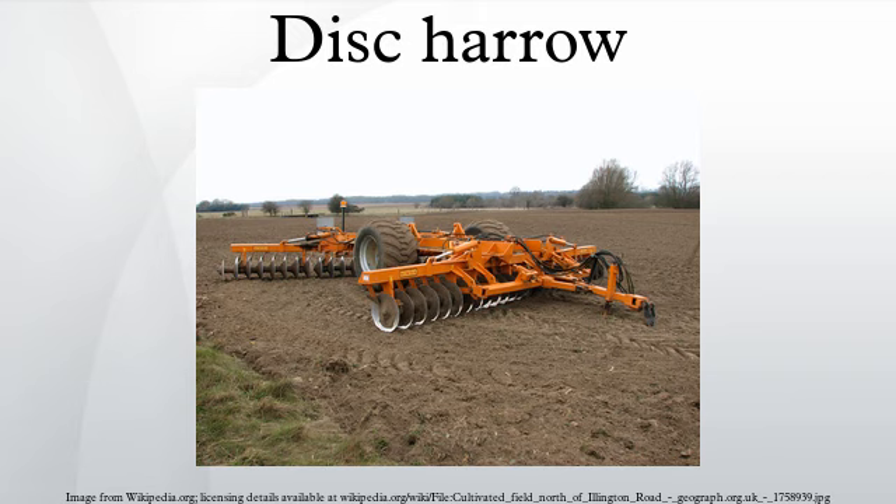Prior to a planting operation, a secondary disc harrow with narrow disc spacing of 8, 9, and even 10 inches, with disc sizes ranging from 20, 22, 24, to 26 inches can be used. Other similar secondary tillage tine implements or rotary harrows are also widely used. When choosing secondary tillage equipment, soil type as well as soil moisture content must be considered. Lighter secondary disc harrows are primarily used to break down soil clods into smaller pieces, allowing water to penetrate more easily, increasing soil aeration, and enhancing the activity of soil biota. The final result is a seed bed that is suitable for planting.